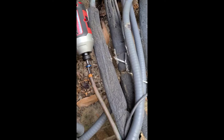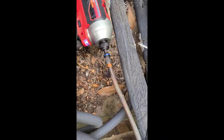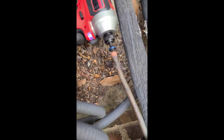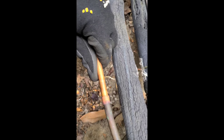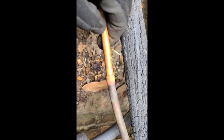This is the swage tool — I have the swage just open. It swages it open so you can see it. You braze that one side and that way you can extend it to wherever you need it to go. That way you get only one braze joint instead of two. Most people use their little couplers, but I really like this method better.